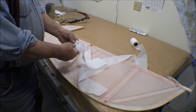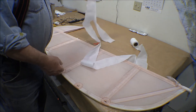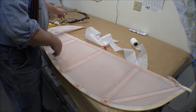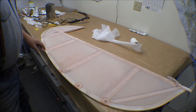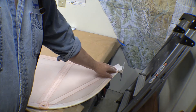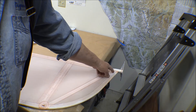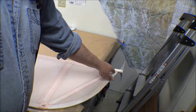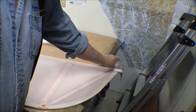The problem with the bias tape is it's only 7 feet long between the seams stitched in there. I laid this out and if I cut this seam off right here and pull it around, I run into my second seam before getting all the way around. So I'm going to have to figure out where to put a splice. When I originally put the tape on this spar, I glued it all the way around to the end. I was just going to run this trailing edge tape up and lap it over a little bit and cut it off, but I got thinking it might be better to run this seam for the trailing edge tape up to here and then cover it with the leading edge tape so that seam is covered up.